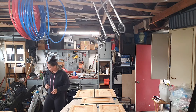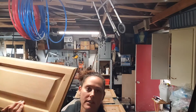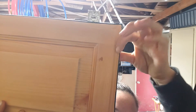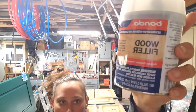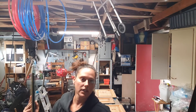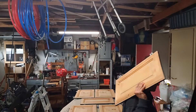I'll show you this door right here — it has some dents and some divots in there, and we don't want that to show after we paint it. This is the Bondo wood filler. You mix it and it dries pretty quickly. I'm going to fill that hole with this, give it another light sand, and then we'll be ready to start priming.